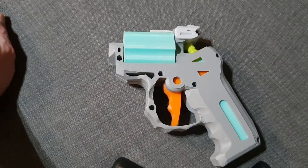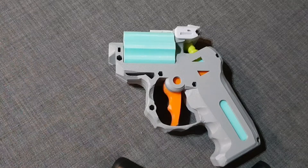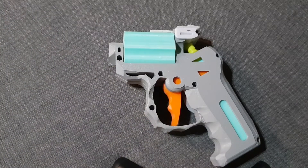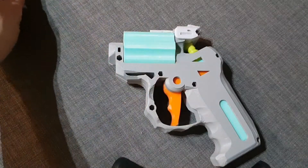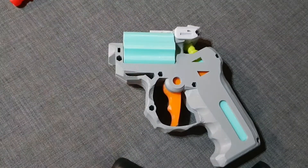Just let me know what kind of problem you are having if you are using PETG, because I know there will be a lot more sanding. I found when I print some parts myself the tolerance is just different — it's too tight, especially for cylinders and for the shells, maybe some moving parts. You do have to sand it, but for PLA the sanding is easy and minimum.